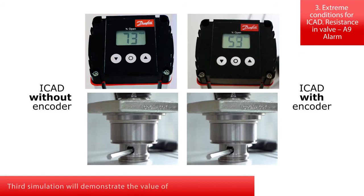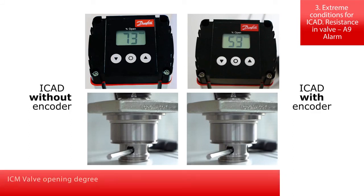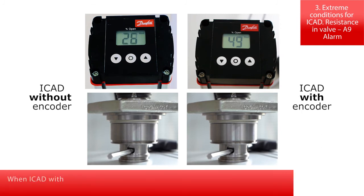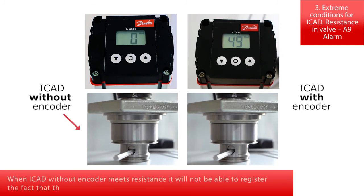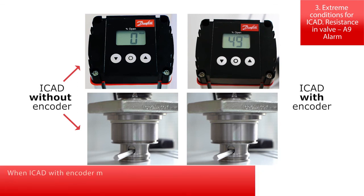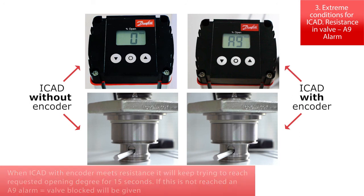The third simulation will demonstrate the value of the A9 alarm functionality. The valve opens and closes as the signal changes. The ICM valve opening degree corresponds with the ICAD opening degree value in the display as long as it does not meet resistance. When ICAD without encoder meets resistance, it will not be able to register the fact that the valve seat is not moving, and the valve and ICAD will be out of sync. When ICAD with encoder meets resistance, it will keep trying to reach the requested opening degree for 15 seconds. If this is not reached, an A9 alarm, meaning valve blocked, will be given.